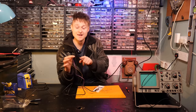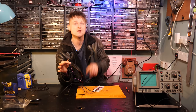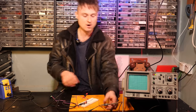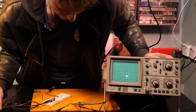Well, there we go. This heart rate monitor right here has three wires coming from it. There is a plus voltage that is about 5 volts. There's a ground, which you plug into the ground, and then there's a signal. The signal isn't a digital signal, it's an analog signal. So we can look at that signal on the oscilloscope. Let's wire the oscilloscope into the heart rate monitor sensor thingamajiggy. Pop it back on my finger. Oh, I'm dead.